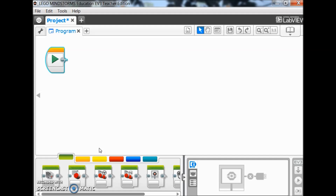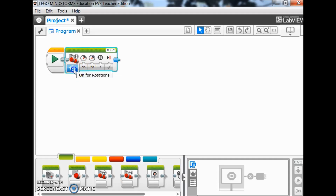I'm going to program the first five turns, just so you can get an idea of what the touch sensor maze looks like. By then you should be able to figure out what it should look like to finish. It's just a matter of switching which motor makes the turn, and it's super easy once you get the hang of it. The first thing you're going to do, like the color sensor maze, is use a move tank block that we're just going to turn on. I tell my students to drop that speed to around 30, so they can see what's going on and it doesn't go too fast. Especially with the touch sensor, you want this to go slow so you have a chance to time it right.